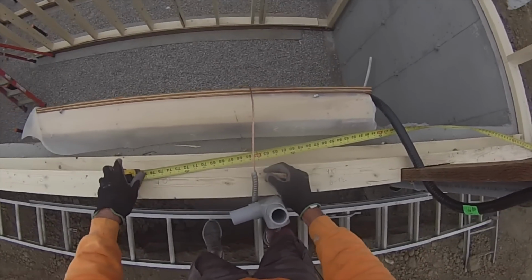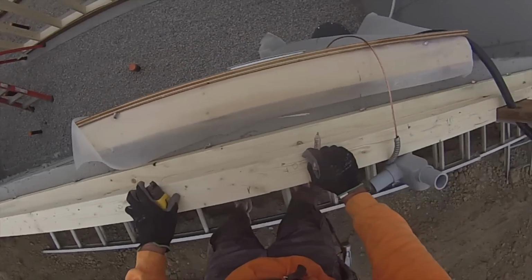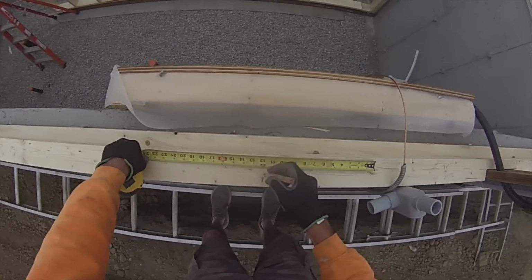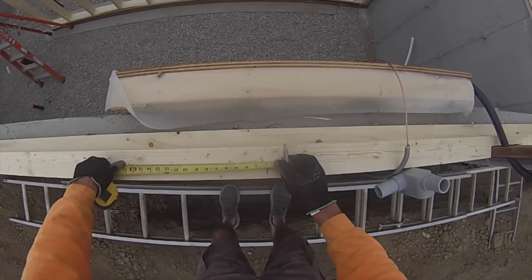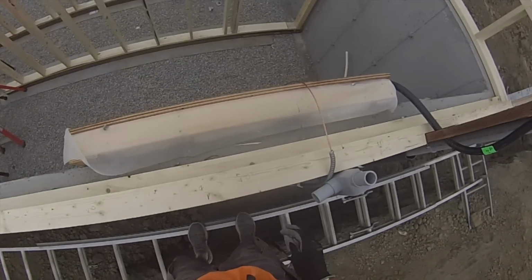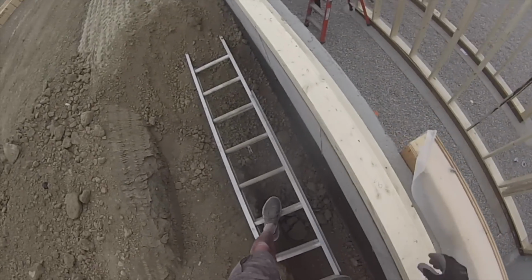and there's no floor truss under the 2x6 wall, and I can see now that we're clear of the toilet flange. If I come out 12.5, that center on the flange, give me 2 inches on either side, and this is where the truss is. We are perfect. So no trusses need to be moved on this home on the main floor.